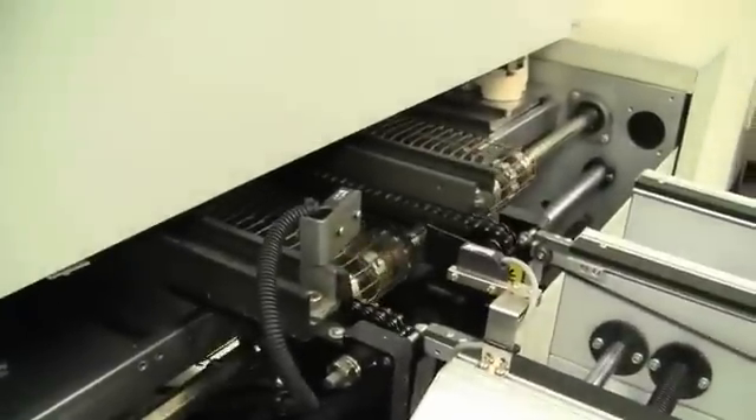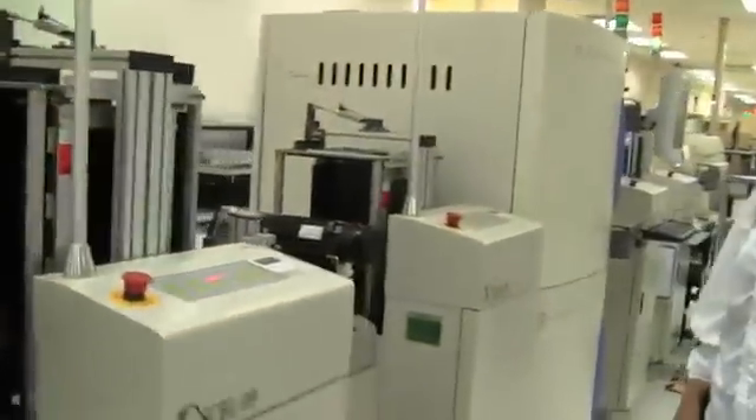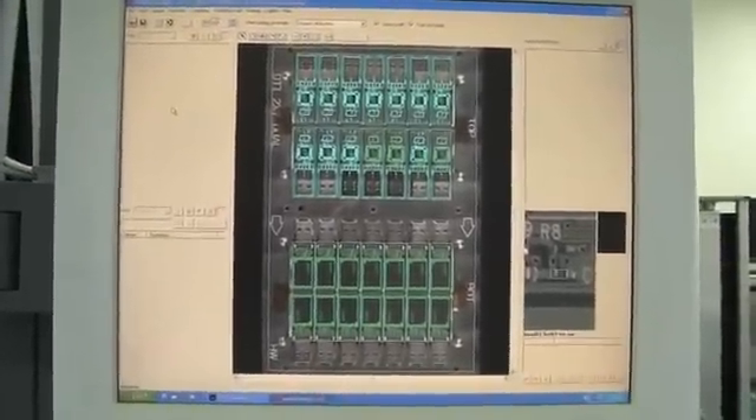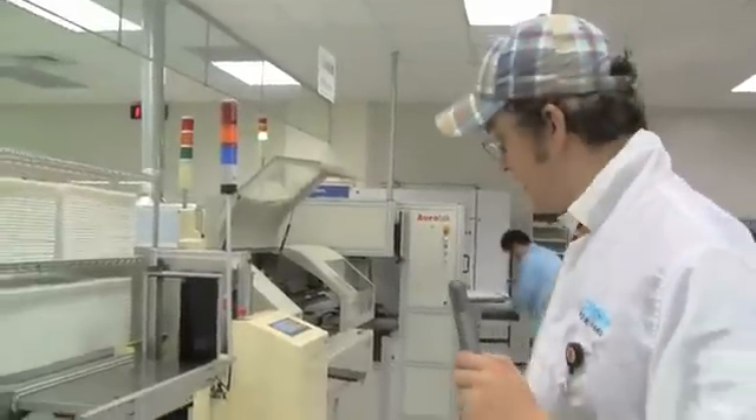Finally coming to a kind of in-between step — they're getting out of here, getting rearranged, repacked into new magazines, to finally then go into the so-called AOI, that's the automatic optical inspection, which is the final check for the USB sticks before they're getting into their packaging.